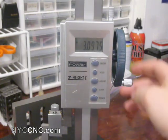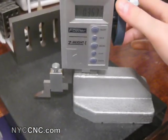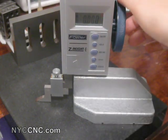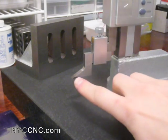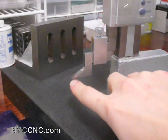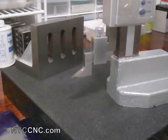The Zero button is how you calibrate it — you move it down to the bottom of your surface plate, it should read zero, and you hit Zero to reference it. Another important feature is that the tip on this one is a carbide tip. Some of them are not carbide tips, and you want to make sure it is a hardened carbide, because a lot of what you're going to do is make scratch marks on steel for laying out, and you want that tip to be hard and not wear away.